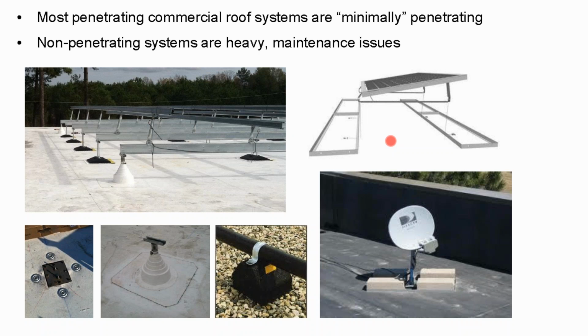I would hate to have, the fire might not be the solar array's fault. It was in that case, but it might not be. In that case, they didn't plan for expansion joints. And so your copper wiring and your metal conduit expanded at different rates, frayed into your home run conductors, and then they had an old style inverter that has a blind spot in it, and it just hit that blind spot correctly to the point where it started this fire, and then that added weight causes additional problems. Why add the weight if you don't need it? That's dangerous. As a structural engineer, you should think that might be unethical.